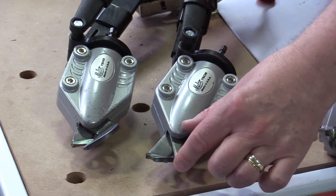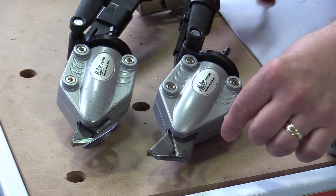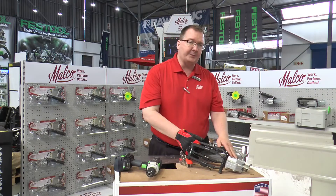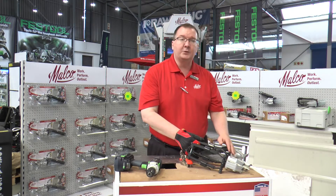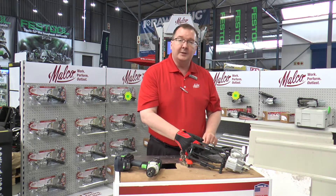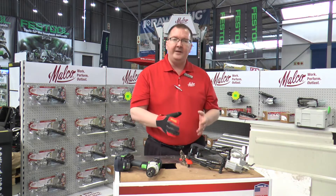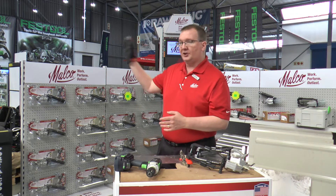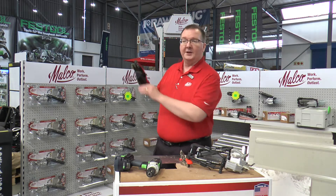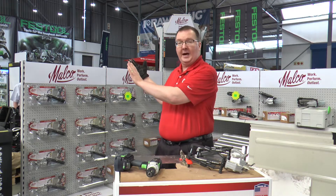Because of the smaller blade, it's only able to cut 1.0mm thickness. The blades are set farther away from the tool and at a different angle than the Turbo Shear Heavy Duty. This allows it to cut corrugated metal roofing as well as IBR panel, where you have to get into the inside corners to make a nice cut. Both of these snips operate like a red aviation snip — they cut straight, a little to the right, but are very aggressive going left. You end up with one good-quality side and one scrap side.